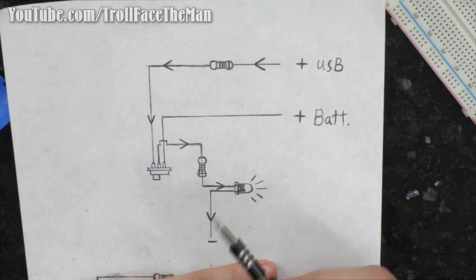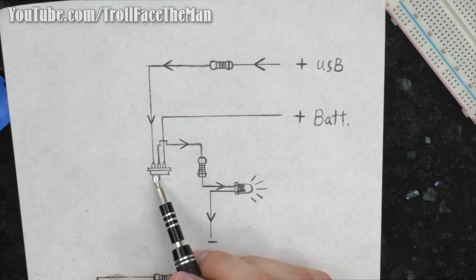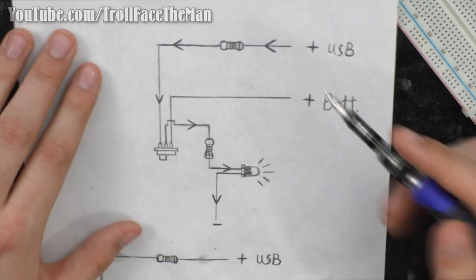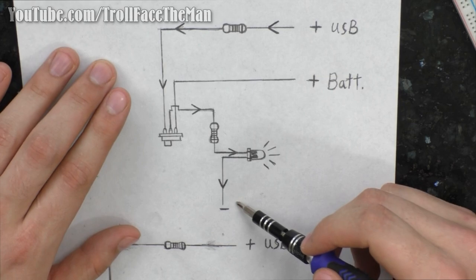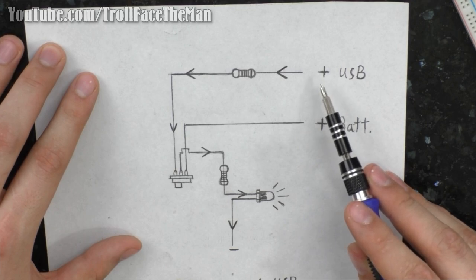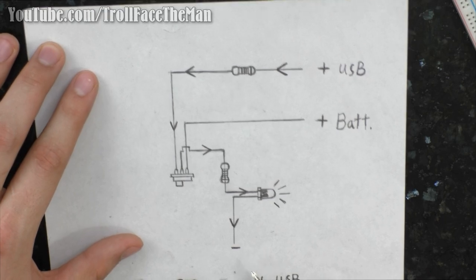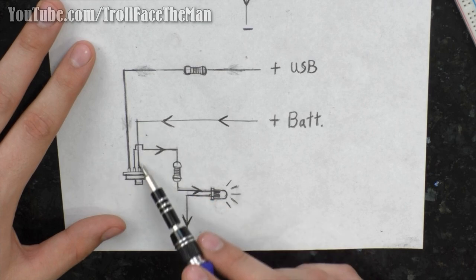But the toggle switch has connections between pin 1 and 2 or 2 and 3 at any given time, meaning that if I have the switch on this side, these two pins are making contact, and if I have the switch on this side, these two pins are making contact. So it's actually quite simple. We have the center pin be the output going to the light and to the ground, which means that when the switch is in this position, it lets USB power flow through there, through the center pin, through the light, and down to ground. Yet if we switch it to this side, it lets the battery power flow through into the center pin and out through ground,